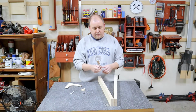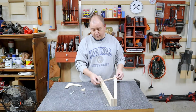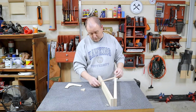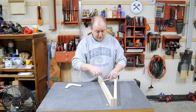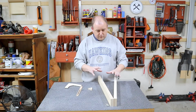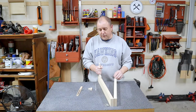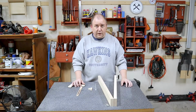Then we have our piece to hold the angle in place once we set it. Then we'll have a permanent screw on this side. I'll take a T-bolt that's going to come up through the bottom, go through there with a knob, so then this adjusts. Next step is to cut all the holes for the bolt to go in. We're going to do a dado to get the handle glued into place. Then we'll attach the hinge to the front. We're getting close.